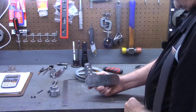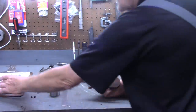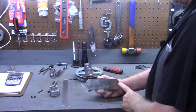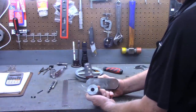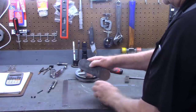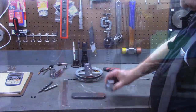We're gonna line the mill up on one of these centers, and we won't need to do a bolt hole pattern. We're just gonna step over 0.615 inches from center in four directions on the X and Y, and in this piece put four holes that will clear a 1/4-20 bolt, and then in this piece at those same dimensions we'll drill and tap 1/4 inch holes. This end will be just drilled straight through for the 3/8 bolts. So let's turn over to the mill now and get started doing this.